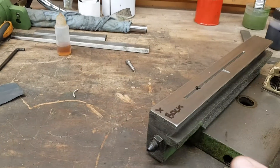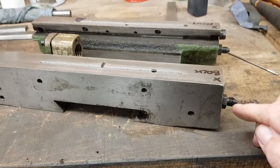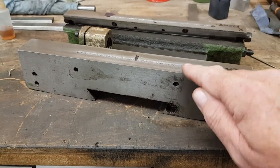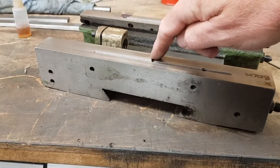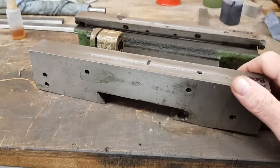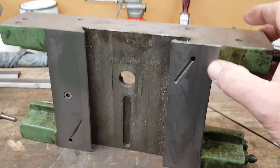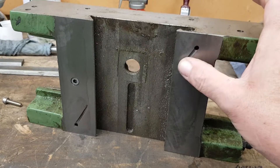The other thing — on the back X, again, it comes in through this port, travels through the casting, and up to this point here, so it feeds the back X way and fills this gallery. Again, if I lift it up, you will see that the hole actually goes down as well and feeds the way at the bottom.